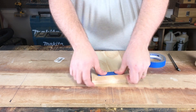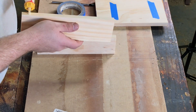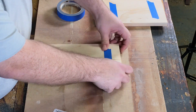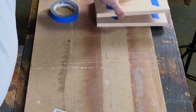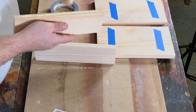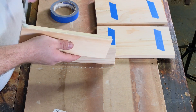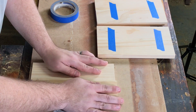It's easy to move the pieces once you actually get them glued up. And the tape is springy enough that you can actually tape things down and put a fairly decent amount of clamping pressure on it without having to apply clamps that are going to scar up your wood, be heavy and in the way. The technique is to spread the glue pretty evenly — I buy these cheap acid brushes off of Amazon.